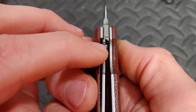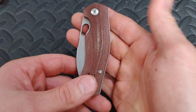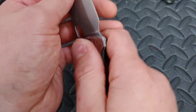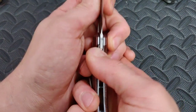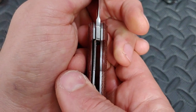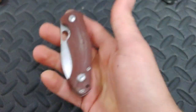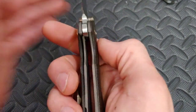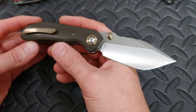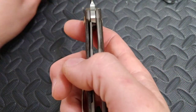Let's look at a couple of lock faces that are very early lock-up. Now you see how that's almost all the way under it — I like to see my lock bar completely under the tang. This is the Ace Biblio — I did mod it and took off the flipper tab for better ergos — but you see the lock bar under there. Now this was very tight. When I first got it, it actually had lock slip because it was literally only locked up like that, so I could literally push past it. Now it's locking up right into place after flicking it and flicking it — it's worked its way into a nice tight spot. This one had the same problem at first. Andrew Tool sent me this knife — this is the Nova Blades Javelin.